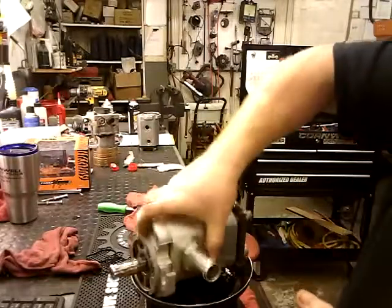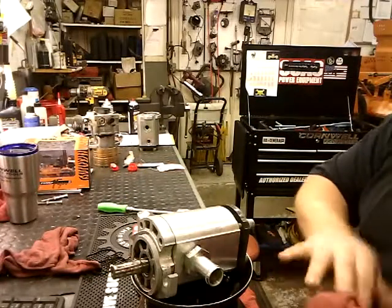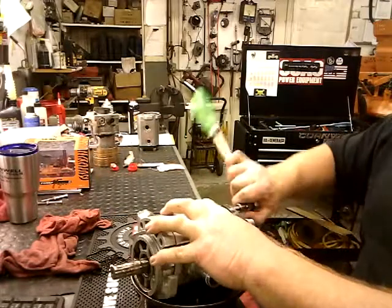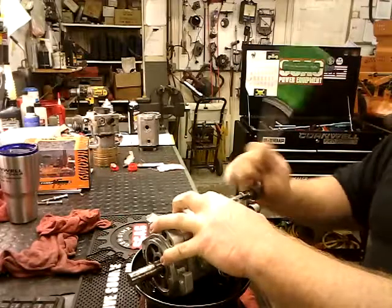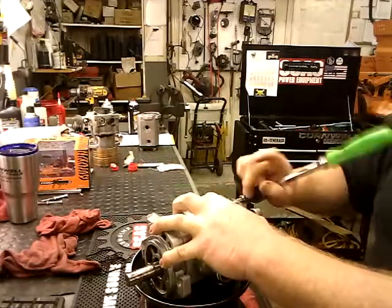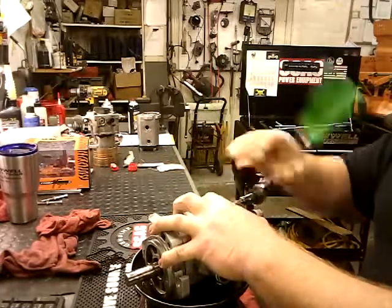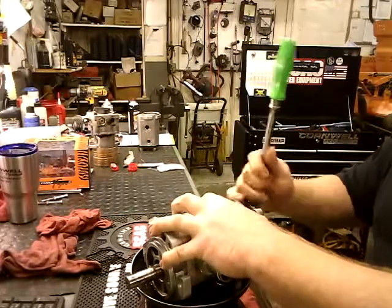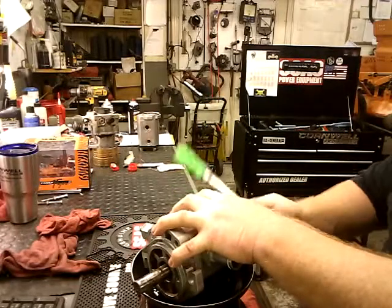Go ahead and torque everything down to 45 pounds. Now, I would not keep the old seals. We know they're bad. They were leaking. I just have a hard time using impacts or cordless drill drivers on some of this stuff. And that's 45 foot-pounds, not inch-pounds.